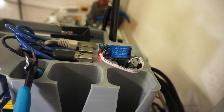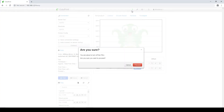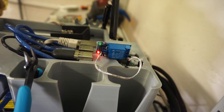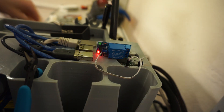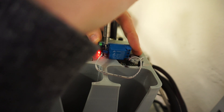This relay board actually has reversed logic, so set the GPIO pin to low and the relay should turn on. If the green LED is still off and you didn't hear any click, then you need to adjust the trimmer to a position where the relay will turn on.